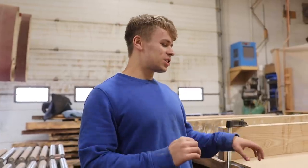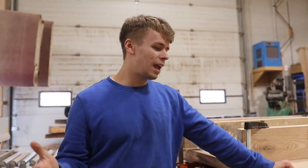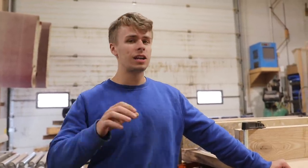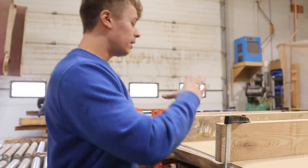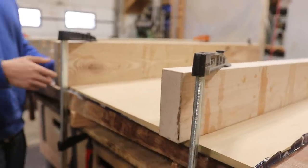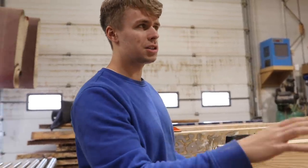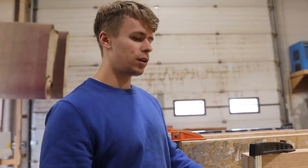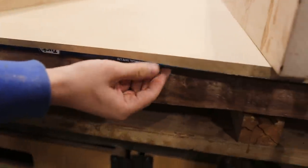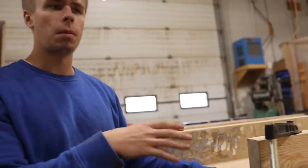It's Friday today, so this is going to be about the end of the vlog. We want to go over what we got done in the shop this week and what we have planned for next week, because we did sell a couple of tables this week with some really neat ones starting next week. This piece here is the Alice and Dawn table - the small one. Dennis and Ben this morning got the mold put on the bottom. It's basically a big sheet of MDF with silicone to seal everything off, and we've coated the MDF with tuck tape, which is what's going to make sure the epoxy doesn't stick when we do our pour.